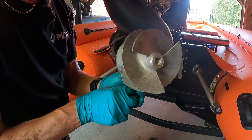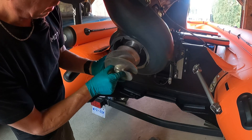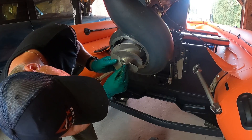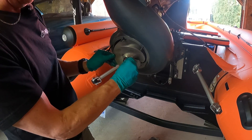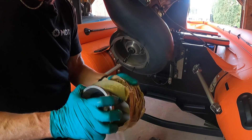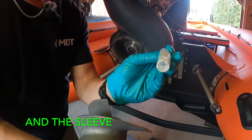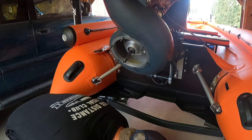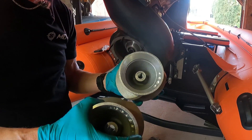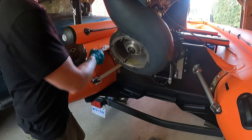Here's the old impeller. The keyway slides in like that around the shaft on that side. When I go to put it back on it's just going to go on like that, the key fits right in, then shims exactly the way I had it before. Now let's have a look at the new one — inside I've got my key. Let me compare the two. They look exactly the same.